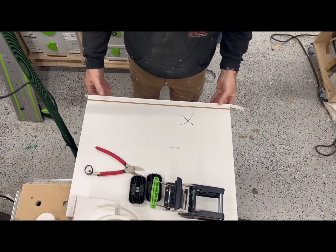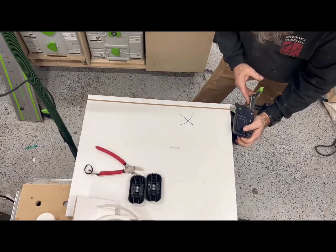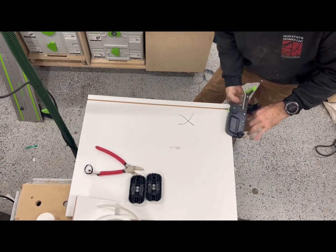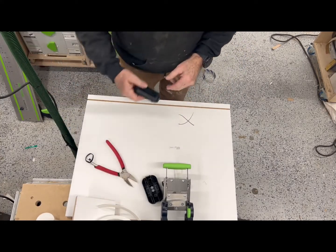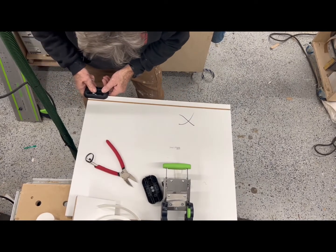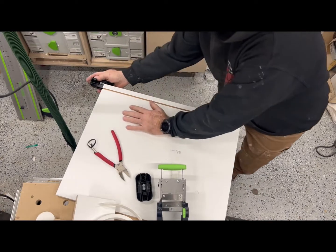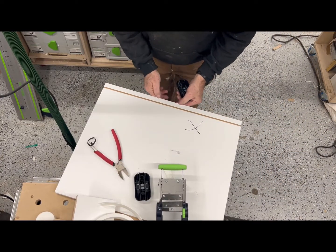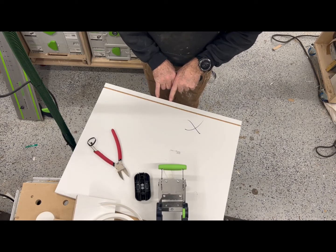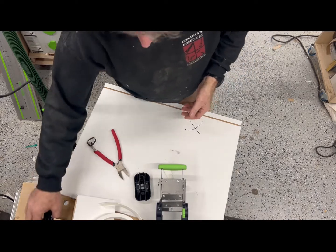And that's on there. So now I've got a cutter that comes in here. What that does is it has this little bead of glue that it melts and puts in here and rolls out there. So it goes on really nice. And that's ready to go. This one's got a little bit of a chip. If I showed you the other side, when I cut my panels, it's got a little breakout from the saw. If you looked at this other side, it'd be a nice clean edge, and I picked my panels based on my saw cuts that way.